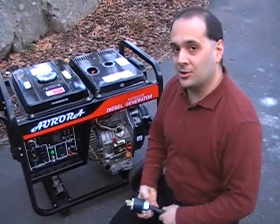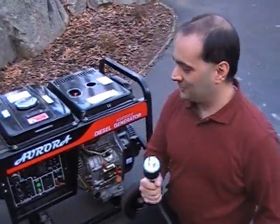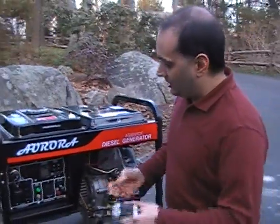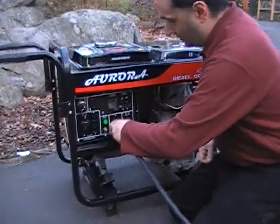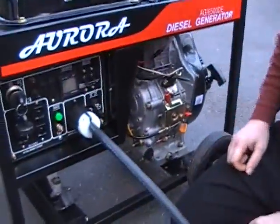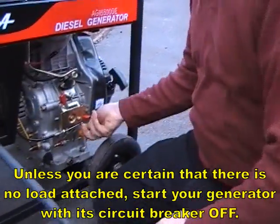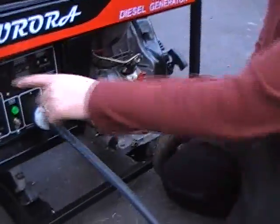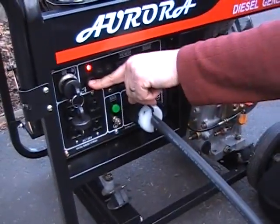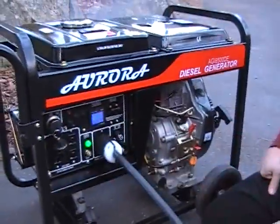So you're at home minding your own business when suddenly the lights go out. But you're prepared because you've got your generator. This is a diesel generator. I plug in the receptacle — it twists in place just like the other end does. Always check your oil no matter what kind of generator you have. Move the throttle to the run position, heat it up with the glow plug, and start the engine. While it comes up to temperature, let's go inside and throw the switch.